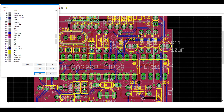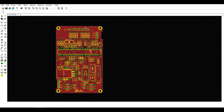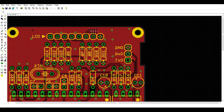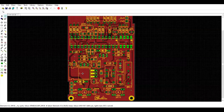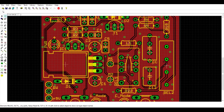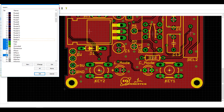This is a double-layer PCB. I'm going to show you the top layer of the board with the silkscreen on. Here's where we connect the LCD — it sits on top of this board. Here we have the UART connector in this corner, the microcontroller, the LM311 chip, two voltage regulators, the double relay, the reed relay, and the two push buttons and LEDs. The board is 80 mm by 49.5 mm.